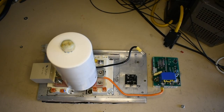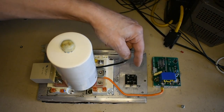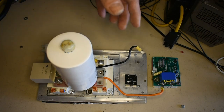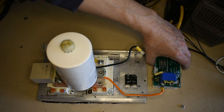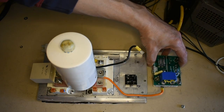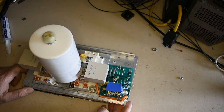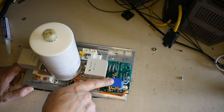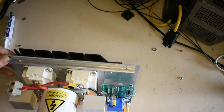I've made this Tesla coil modular because I want to be able to modify it easily. I've already had to take it apart because I now want to change this bridge rectifier. With a slightly softer start arrangement — with this large capacitor the inrush can trip the breaker — so I'm going to replace it with a little circuit made with a thyristor bridge to basically do a soft start on initial power up. This is it with the new soft start bridge in place, and the H-bridge unit ready to go back in.